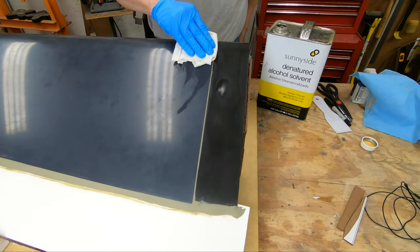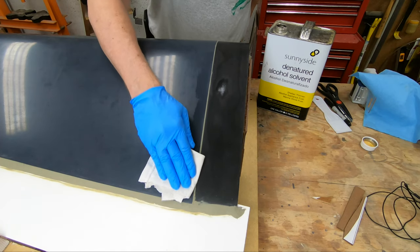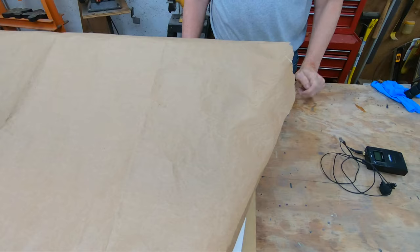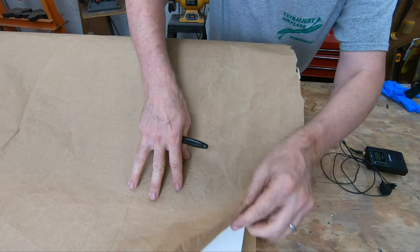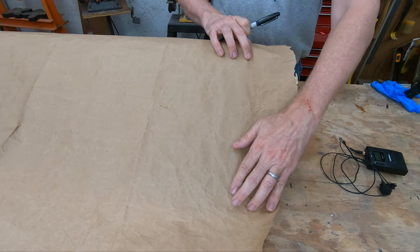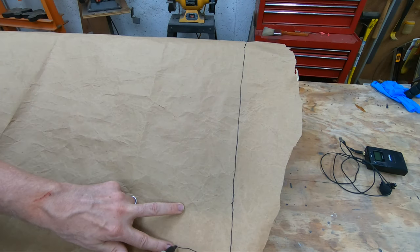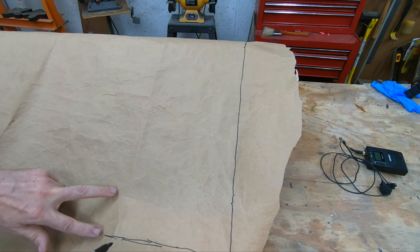After doing all the plasticine work there was quite a bit of plasticine residue around, and I wanted to get rid of it to avoid any blemishes in my mold. I used denatured alcohol and some rags to wipe off all that residue — that worked pretty well. I then wanted to put four layers of 320 gram per square meter fiberglass plain weave cloth on here for the surface of the mold. To know how big to cut it, I made a template using some craft paper — paper I had saved from packing materials, rolled on a cardboard tube to help flatten it — marked it with a marker, cut it out, and had a template.